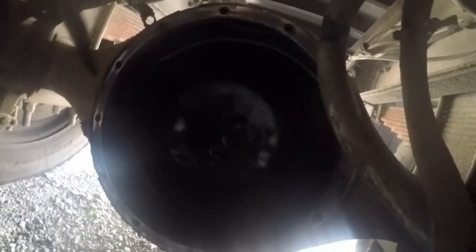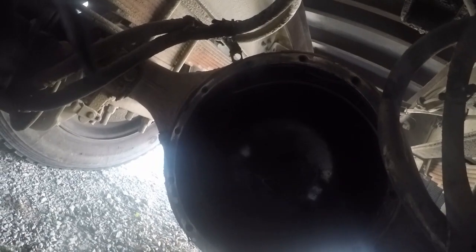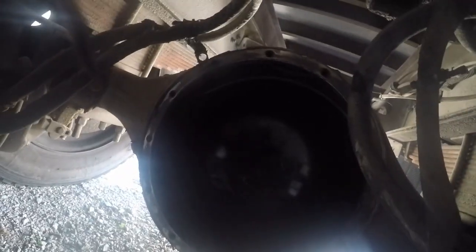And once I had pulled the axles out, I got in the truck and started the truck up, and kicked it in gear, and then I could hear the pinion. You could hear the pinion just rattling in there where it was bad. So I was like, yeah. So definitely the rear end's our culprit. So I'm gonna get my mats laid down here, get this drive shaft over here moved out of the way, and see if we can't get this all cleaned up.